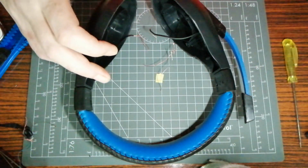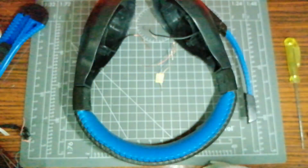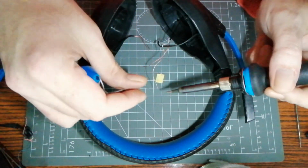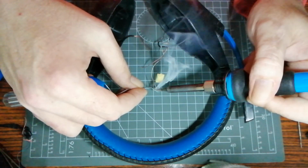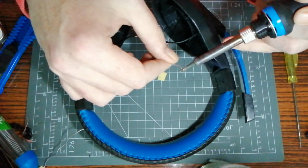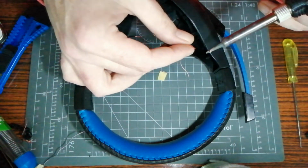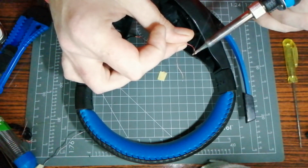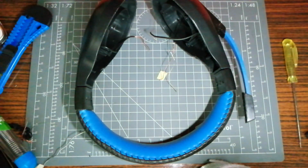Let's get the wires tinned. So, figure out I'm going to do this one, eh? Now that's smoky. Did it tin it though? It's got like a laminate coating on it, yeah, we're good for that. See the kind of coloured thing, it's like a fibre. I think they call it lamination, I'm sure of it. Just got to make sure you keep the heat on it long enough for it to penetrate the fibres. Otherwise we won't have a steady connection. That needs nasty solder.